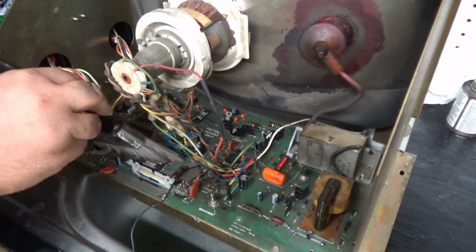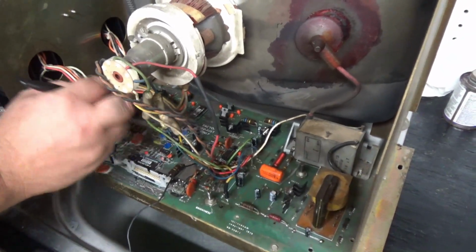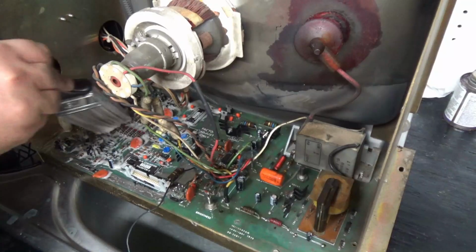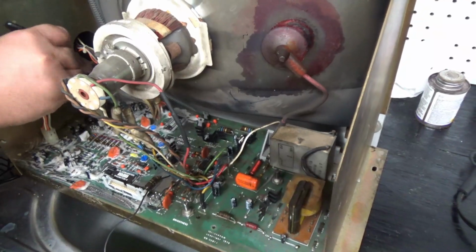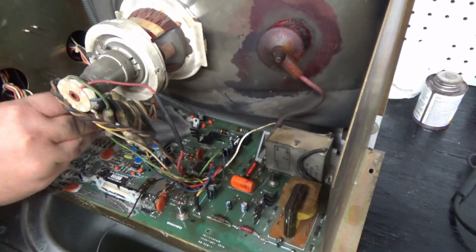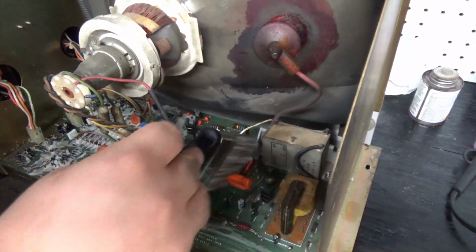I'm just going to try to get some of the dirt off. Work it around a little bit with this paintbrush. Doesn't have to be perfect. Some people say to never wash a monitor. Well, I always wash a monitor, or at least the monitor I care about. The reason why is because all those little dust particles and whatever can attract water and leave all that exposed metal wet and cause corrosion, just the dust sitting there. So I like to get it clean when possible.